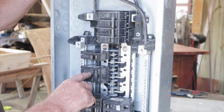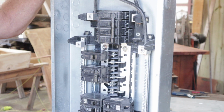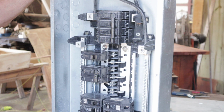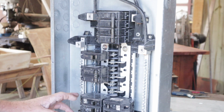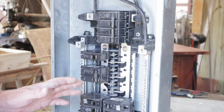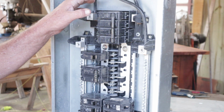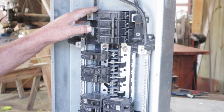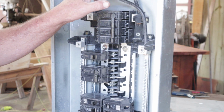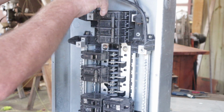So you'll have to achieve that, like I said, you got to go back to everything that I've explained earlier, pulling from both sides in this breaker box. I'll get a little deeper into the video later on with the actual how to wire up these going out. I'm just trying to explain how the breaker box itself works. If this is a new home installation, of course this would probably be 2 gauge, 2 AWG, and that's what this is. Some cities and states require different coded sizes here, so you'd have to check with your local city and state to see what's required on the power coming in to the boxes.